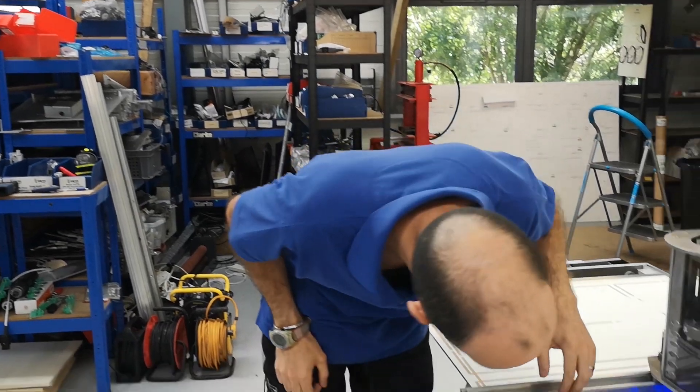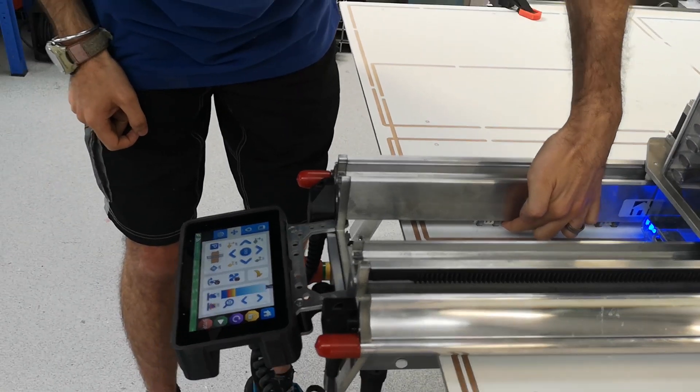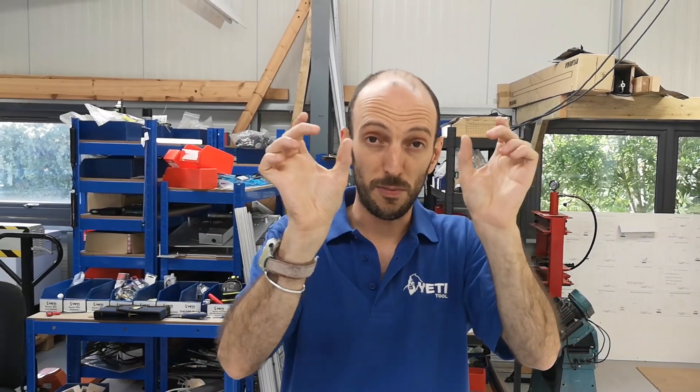Now you might be thinking: that's great, but what happens when you mill off the material which the bearing was previously running on? For that reason we've made the bearings adjustable, so that when you know where the workpiece is you can move those bearings onto areas that you know aren't going to be cut — and that's a solution for most scenarios. In cases where you're actually going to be milling off the entire top surface, so the top bearings aren't able to touch down on the workpiece, we use runners along the sides of the workpiece and reposition those bearings out to the runners. We'll cover those projects and the different scenarios in future videos.